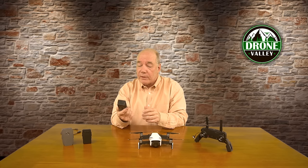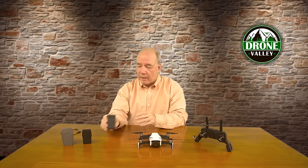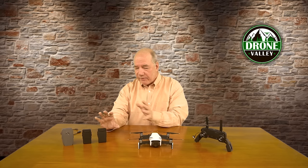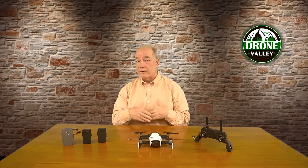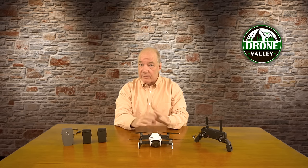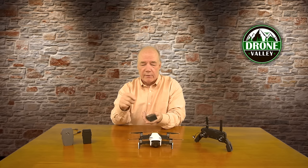Don't fly with a defective battery. I know these are expensive, but if you think about the cost of the drone and this battery goes nonlinear, you're going to lose the drone. You don't want to lose a drone over an $80 battery. If it's bad, take it to a disposal site — I think Home Depot or Lowe's takes defective LiPo batteries. Replace it, because lithium polymer is a very volatile combination of chemicals. If the battery decays to the point where those chemicals touch each other, you can have spontaneous combustion. If it's swollen, it has to go.